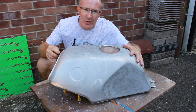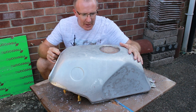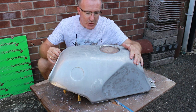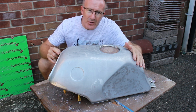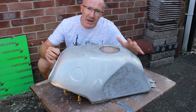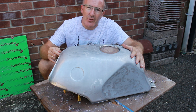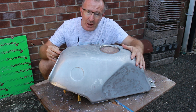There it is — that's the tank stripped of all its paint. I've washed it down and gone over it with a Brillo-type pad and some clean soapy water. The other thing I need to do before prepping this for proper painting is get the other side filled to sort that little indentation, because unfortunately the aluminium is just too thick and too strong and that dent is too old to flex back into shape. I'm going to fill it, get that all prepped and smoothed off, and then we'll be able to look at getting some paint down on this tank. Thanks for watching Dino's Garage, and there will be more videos for the K100 project.